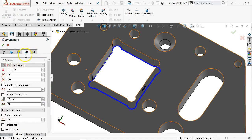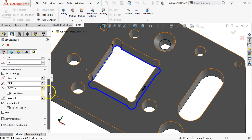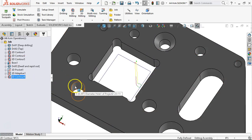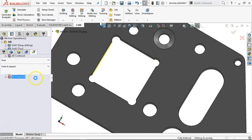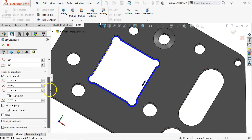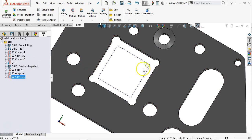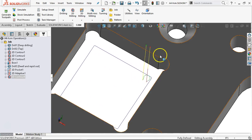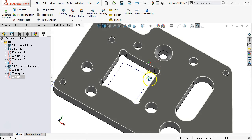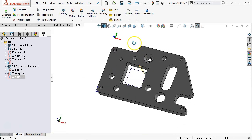Kind of jump through — I'm going to control size, so wear compensation comes on. That's going to get set out at the control. We'll look at the contour pass. Don't really like that it's in the middle — we'll see what it looks like if I start closer to an edge. Entry position: we'll put it into a corner and see what it can calculate. A little bit off of the edge, not quite at that corner but it's close.